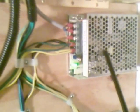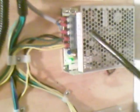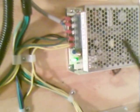My grandpa picked up a power supply — it's a 12-volt, 6-amp unit. I'm not sure exactly where he got it, but it was a really good deal. I tested it all first. I had to make my own wire connections. It basically looks like a computer power supply, doesn't need a fan, runs nice and cool, and never gets hot. Everything stays cool underneath the layout, which helps with the Digitrax command station.